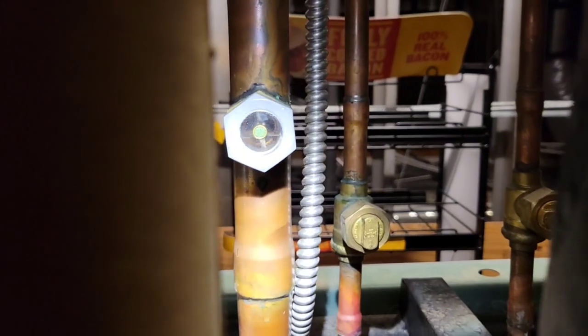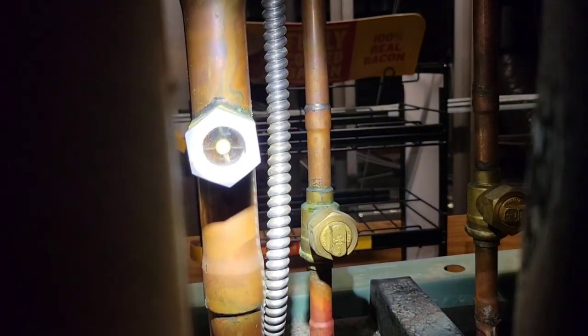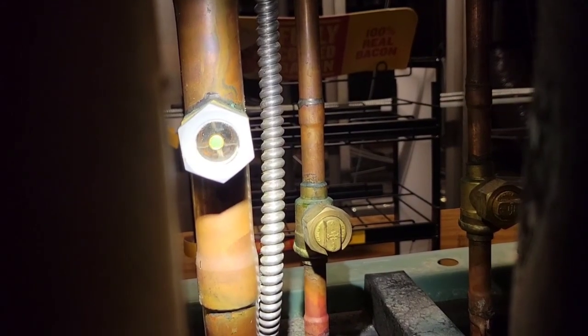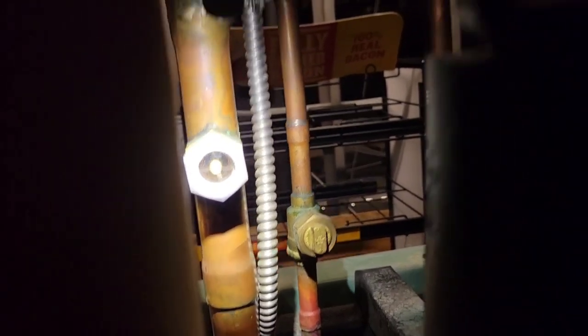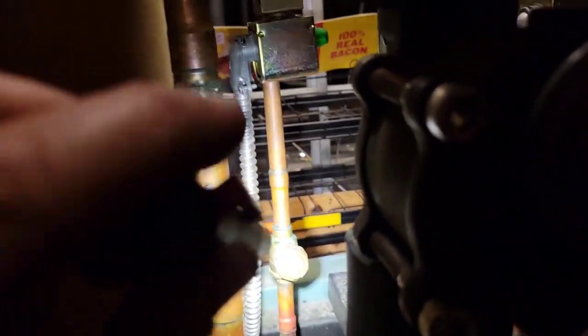This one's much better to see. You can see that the sight glass is flashing — there's half liquid, half gas. There's not a full column of refrigerant going to our TXVs, and that's going to make our TXVs inefficient and not work properly.